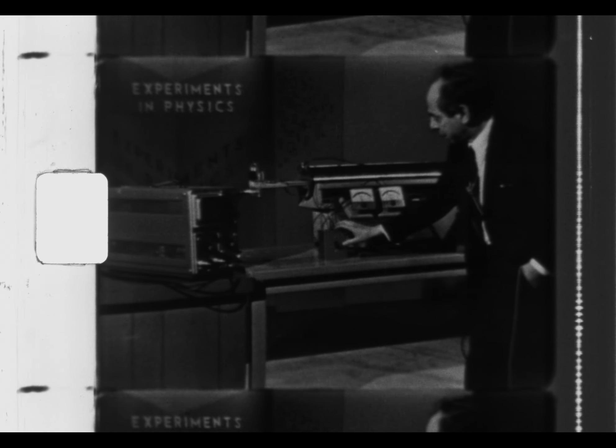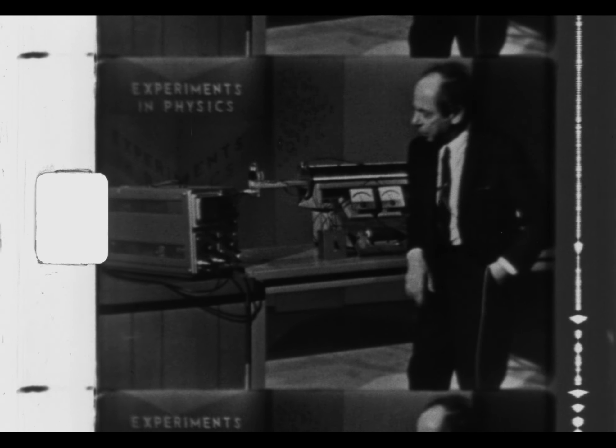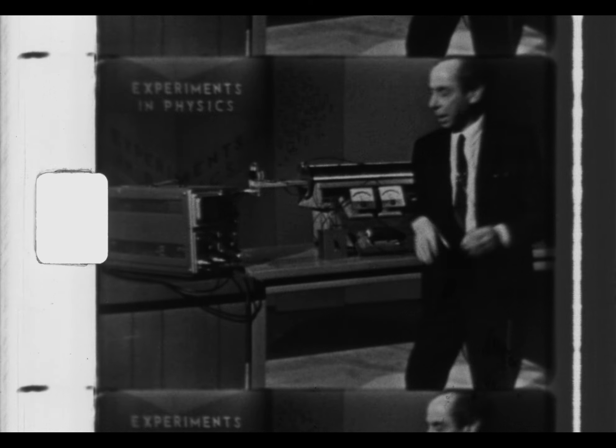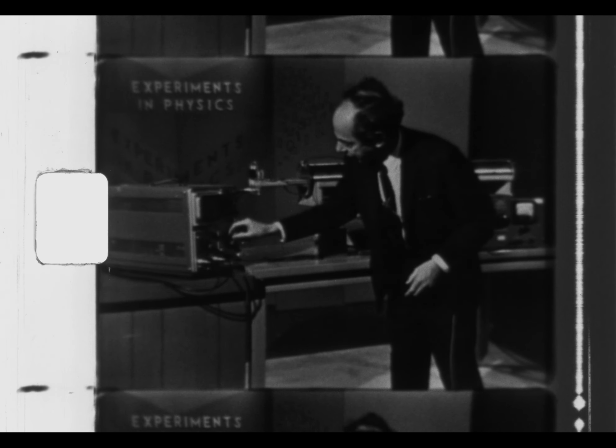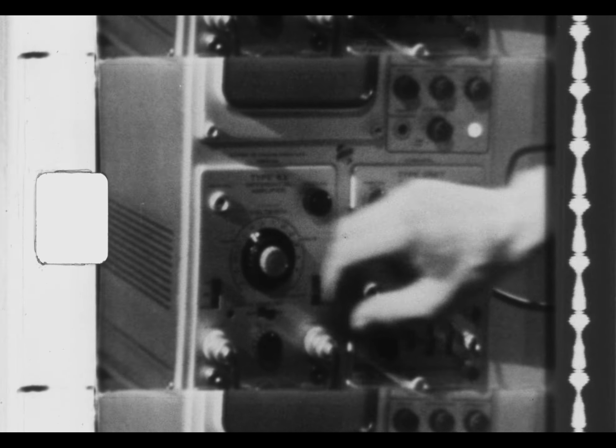We will want to look at the voltage developed when I short out the coil. The scope is set so that we have a differential amplifier. The reason for the differential amplifier is that we're looking at low voltages, and these exposed wires can pick up a lot of AC. If I put this on a fairly high gain and ground one side, you can see even at half a volt a very wiggly trace which is due to the AC. So we use the differential amplifier to keep that smooth, and we will want to look at much more sensitive positions — say, two millivolts per division.